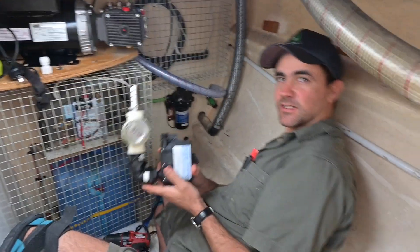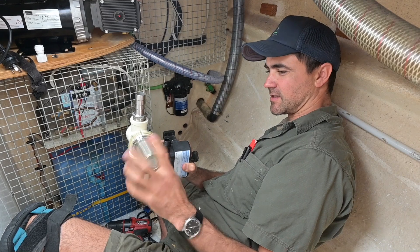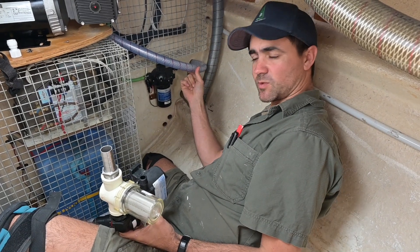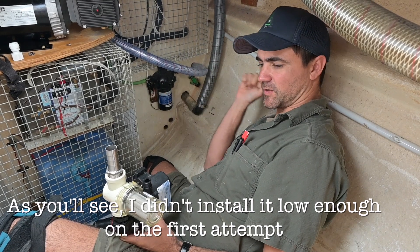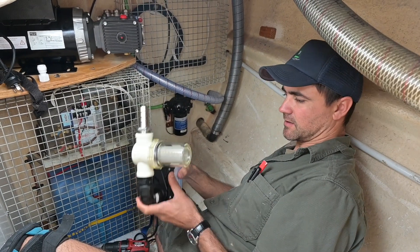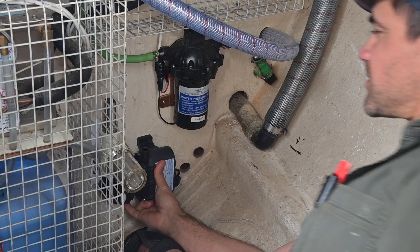We have our lift pump, which is a low pressure pump. I've got all the fittings gelled together as our sea strainer, and this unit is mounted below the water line. It's going to pump raw seawater through the primary filter — the sea strainer — then up through the other filters to get to our pressure pump, which will then go to our membrane. This little guy has taken quite a bit of work to get lined up. We've built a little backing block in here and it should look like that when it's all fitted.